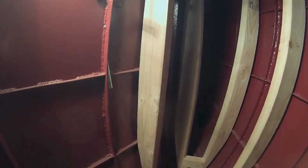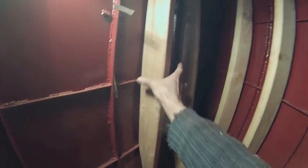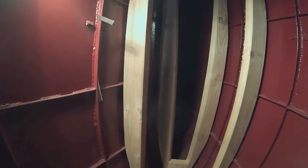I thought of a better idea than using a piece on the bottom through those notches. I'm going to wrap all of the wooden frames in aluminum channel — about an inch and a half in — and I'll weld tabs to the ribs and bolt it on. That'll strengthen the hull while at the same time giving me some wood to attach all of the floors and walls to.